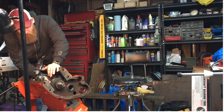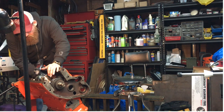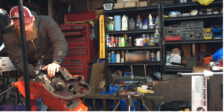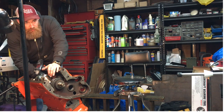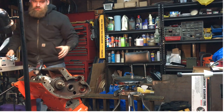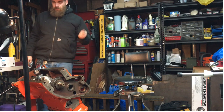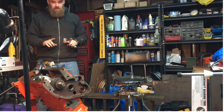We ended up putting it in the fire. We got a little, kind of like a forge, not really a forge, but I just use it for heating up stuff. I put a bunch of blacksmith coal in there. It's, I don't know, for another video, but coal in there and get it hot, and then I can have different levels that you can put something. So you can have something red hot or medium or all the way to the top. It works pretty good. So I was able to get that hot enough, and it slid on about halfway.